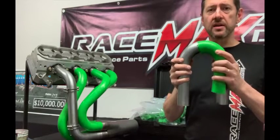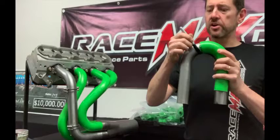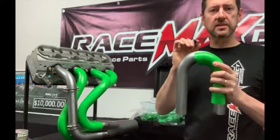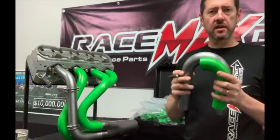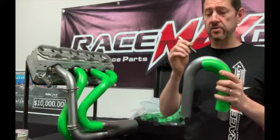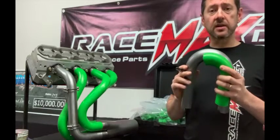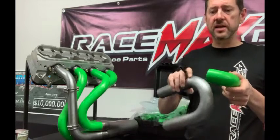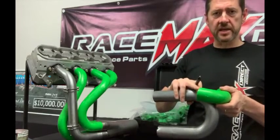You transfer your cutting lines and then cut on your bandsaw to produce that section. You can also use their optional cutting jig, which makes the job very accurate and easy. It works in conjunction with your bandsaw, lining up the plastic blocks exactly with the cutting blade, so you can transfer it onto the pipe and cut quickly, safely, and accurately.